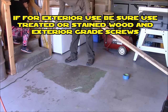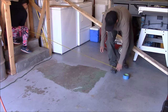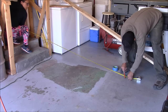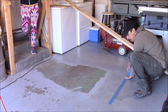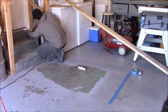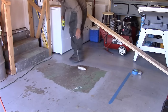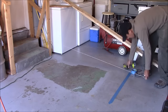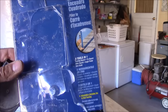To start, I'm going to measure from where I want the top of the ramp to be, measure out with a tape measure, pull it nice and tight, and make a mark at 8 feet. After making my marks, I'll mark it with masking tape just to see it more clearly. Now I'm going to use a string line and secure one end at the highest point of where the ramp's going to be — I just used a screw to secure it. If you don't have a way to secure it, you can have someone help you hold the string in place.